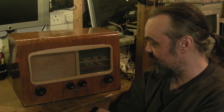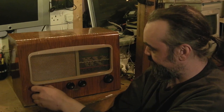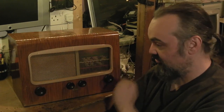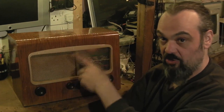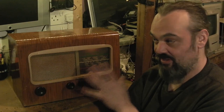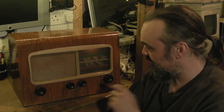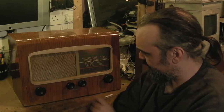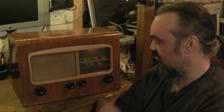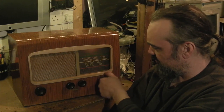With the number of stations it's actually picking up, I think the other capacitors we can at least leave them for now. I'll switch on and we should get the radio to play. I've cleaned those connections up on the aerial and earth and I've got it connected to its loop aerial inside. I'll probably get a bit of background noise because it tends to pick up from my lights, the camera, and the switch mode power supplies. Here we've got the radio playing.